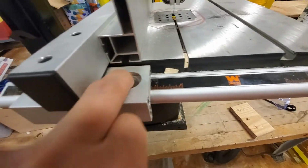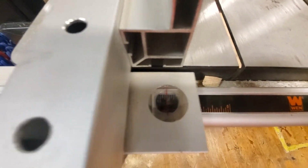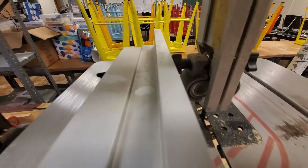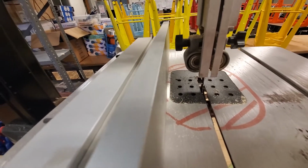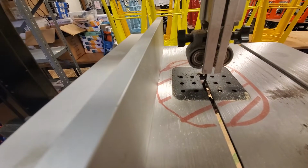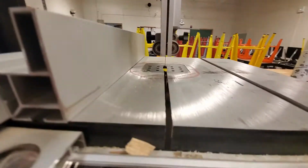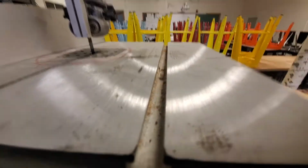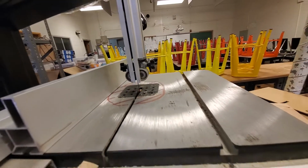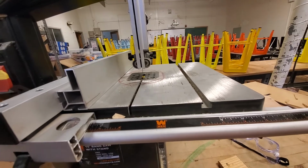You would look here, in that window, and that would tell you how close you're cutting. So if you wanted to cut 1/2 inch, you couldn't, because it's too close. And we never want to cut anything that small anyway. Smallest we want to cut something is about 2.5 to 3 inches. So we don't have our miter gauge, but the miter gauge would go here and it would help us cut at a specific angle. Those are all of the parts that we need to talk about.